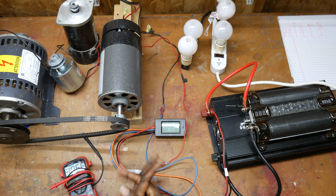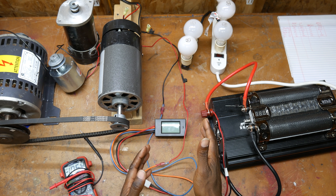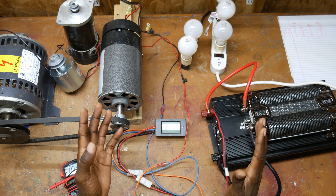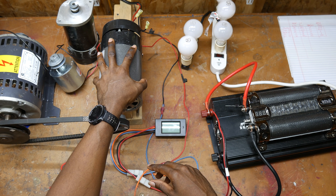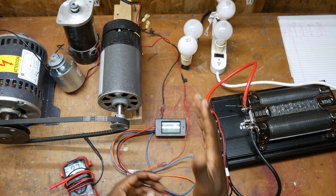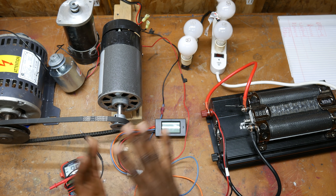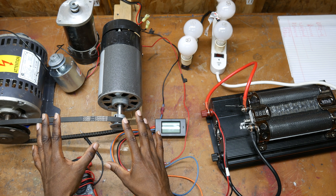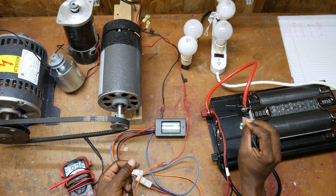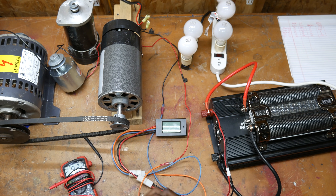How do we solve this problem? The best solution I can come up with is to run your inverter off of a battery. Put a 12-volt battery in the system, which will give pure DC to the inverter — I've already tried this and there's nothing wrong with the inverter when hooked to a battery. Then I'll charge the battery with this generator. But there's an additional problem: the battery itself wants a very specific charging voltage, which means I need a charge controller — about $90, but it's for science. I'm going to get that charge controller wired up. It can receive up to 100 volts, which is perfect since I want to operate at about 90 volts. The charge controller will step down the voltage and manage the different charging parameters as the battery goes from 30% to 90%, so you really do need a smart controller to manage your battery if you want it to last.